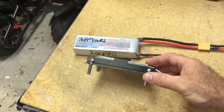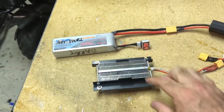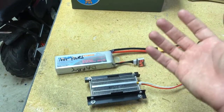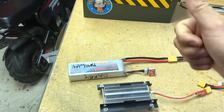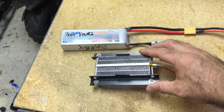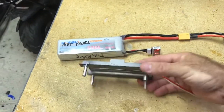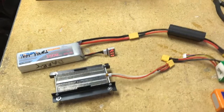You can get one of these little devices off Amazon, relatively cheap — around $15. It's called a PTC heater. It's a real simple device — all it is is a resistor. You put power to it, and the resistance is low because the temperature is low, but as it's pulling amps the resistance goes up, the heat goes up, and at some point it plateaus. The amps level off and even drop to whatever it's rated — I think this is about a 100 or 120 watt PTC, so it's going to pull around six to seven amps once heated up, maybe 12 while heating up. It's a simple self-regulating resistor — super smart and easy to use, and much quicker than waiting for your home charger.